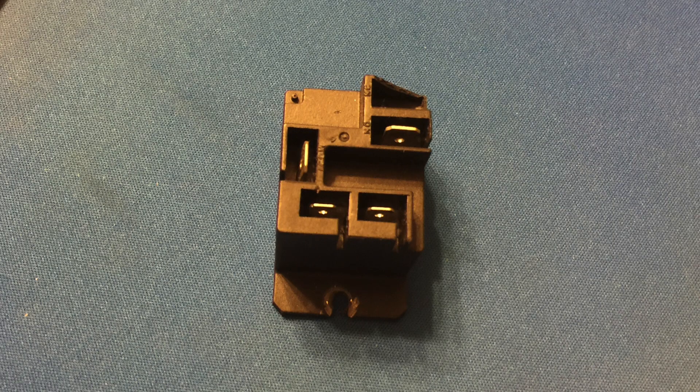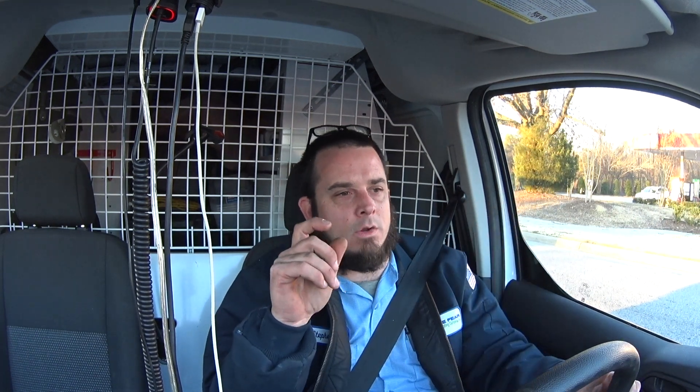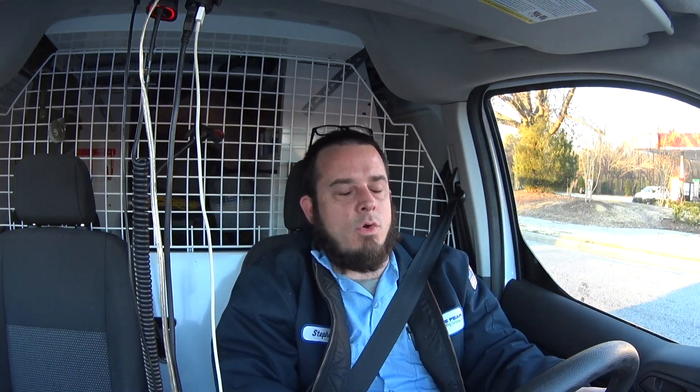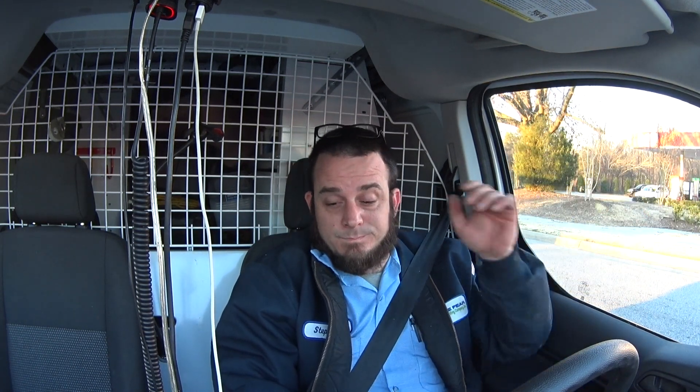The biggest issue that we started to run into was the DC voltage controls, but once I found a relay for that, everything was working like we intended it to. I used the DC voltage relays out of a carrier heat kit — it's the relay on the carrier heat kit that has the little adder block that converts 24 volts AC over to DC voltage. We were simply able to pull that little adder block off and use the DC coil to isolate the circuit. In the end everything worked out — I hope you guys enjoyed the video, like, subscribe, comment, and share, and we'll see you on the next one.